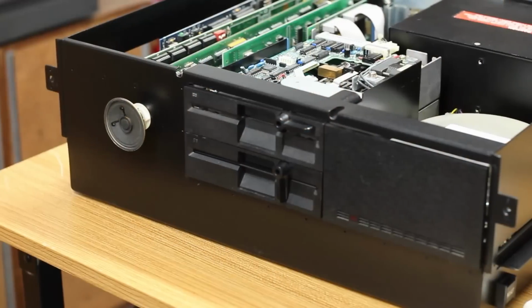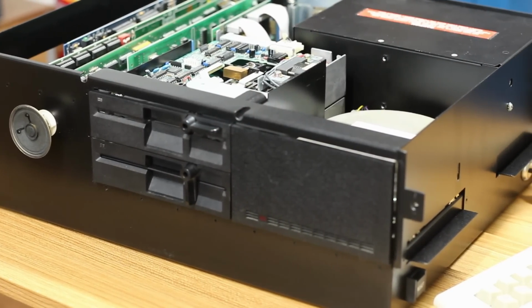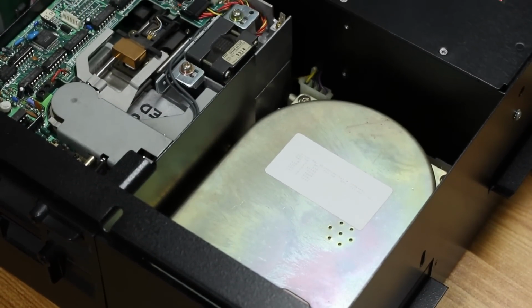Let's put something back into the EDS PC and see if we can't actually get a hard drive functioning on it. All right, I've got the ST238R back in the machine and all plugged up, and it spins up and sounds totally fine, which we saw, as the flux readings seem to work totally fine. But I'm pretty sure that it's not being picked up by DOS. So I've got a generic MS-DOS version 3.3 disk in there.